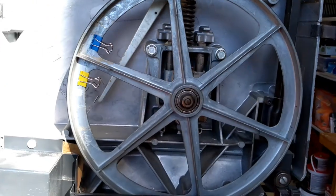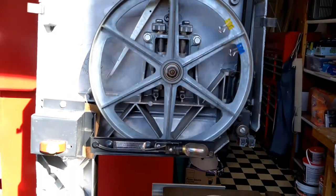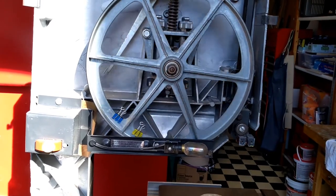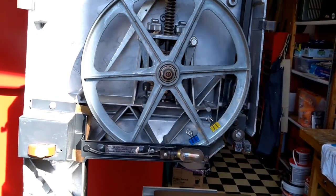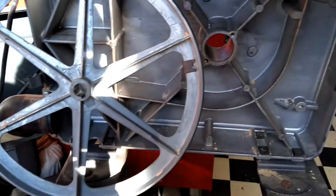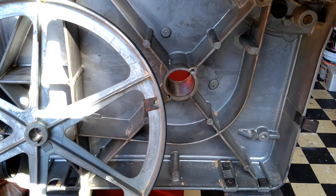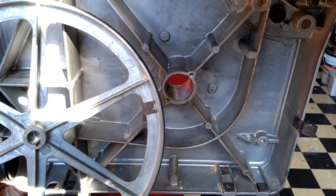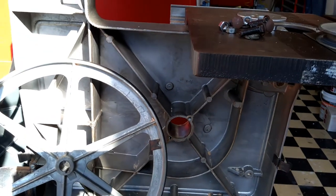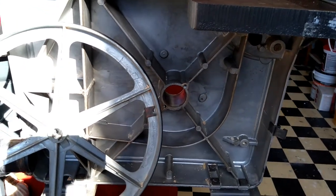Here's the backstory on the great snap ring adventure. I was trying to balance the wheels on my bandsaw — a very old bandsaw. You can do it on the top wheel because the bearings are still really clean, so the wheel spins fine. But when I tried the bottom wheel, it would stop very quickly, so it was pretty obvious the bearings are not nearly as good. I had to make up my mind to pull it apart and replace them.